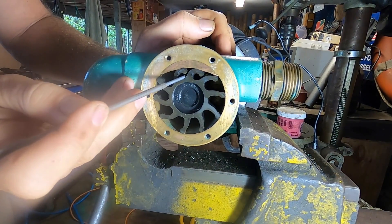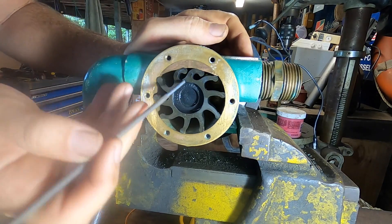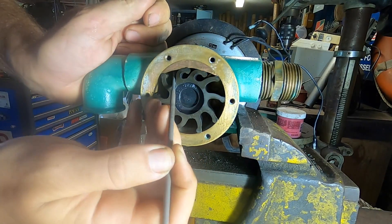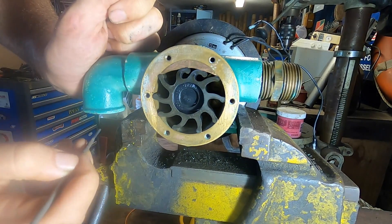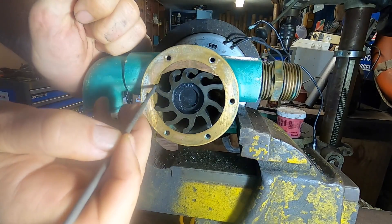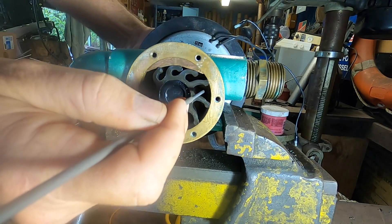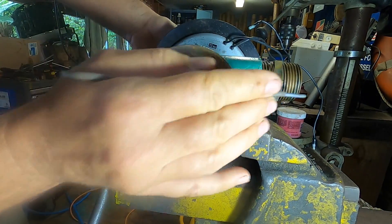What happens here is you have a chamber going from a small volume to a large volume, pretty much identical to the idea of when a piston drops inside an engine and draws air in. As it rotates, this chamber starts to grow in volume. Up inside this cam there are actually vents — it's not solid. As the pressure inside here drops, the pressure on the outside is atmospheric pressure, so water comes up and fills this chamber. Once this slope's reached its natural curve for the round section, from that point onwards it's simply carrying the water around like a paddle wheel. Then it gets round to here, that chamber starts to shrink again, and that water gets pushed up through the grills in here and out the outlet.